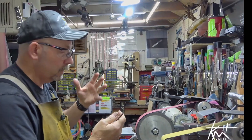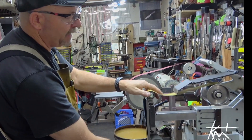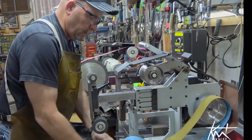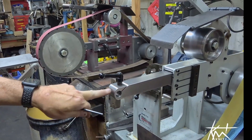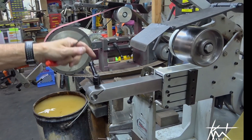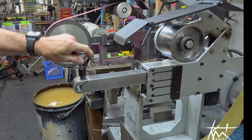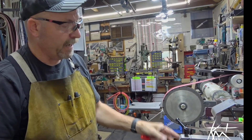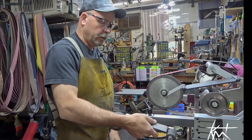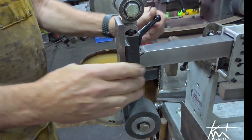Now let's talk about some features of this platen. I'm going to loosen it up and pull the platen out. The tooling arm is set up with a three-quarter inch hole in a clamp-down style. If you have a milling machine in your shop or a three-quarter inch drill bit you can do this yourself - it's not really that difficult. As it comes you'll have the tooling arm, the three-quarter pin that goes in it, and of course you've got full rotation.